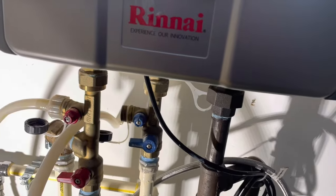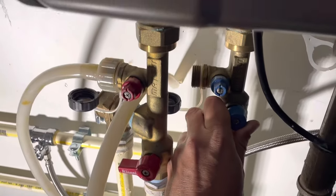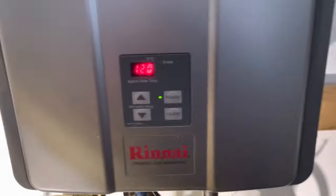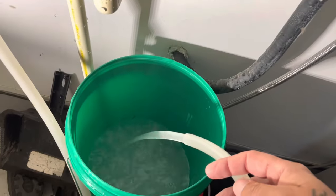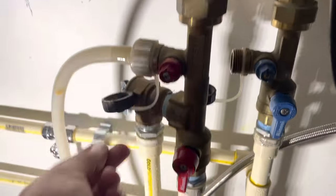We've got a couple of buckets full drained out. Now we're going to plug the water heater back in. With the flush valves off, we're going to restore water to the water heater, and after it starts up we'll open this valve again and let it make hot water — get a couple of buckets full that way too. Water heater's running, we're making hot water. With water restored to the house and both flush valves off, we just have to disconnect our hoses, put our caps back on, and we're done.